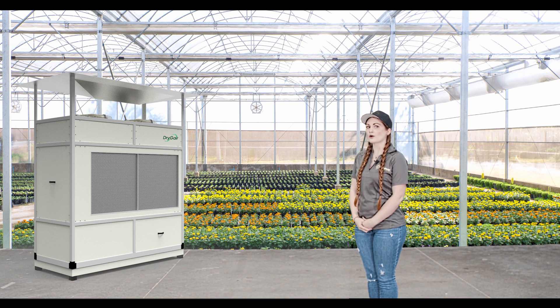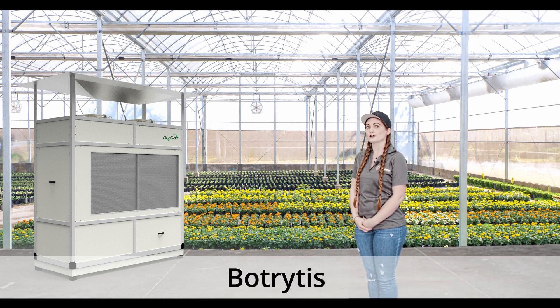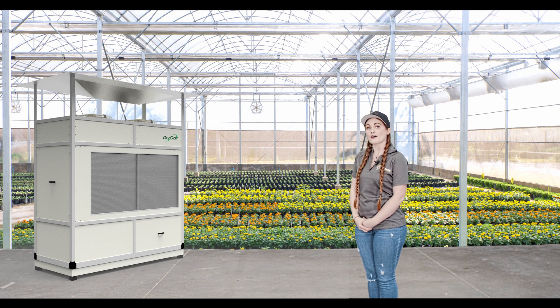Brands A, Q, and Z operate more like a traditional fan because they simply blow the treated air out in a single direction. Combine the inability to push treated air throughout the room with low CFM and you have a recipe for microclimates and crop diseases like powdery mildew and botrytis. Oftentimes, the grower will place ceiling fans throughout the growing space to assist the dehumidifier with air circulation, but that solution can oftentimes make matters worse by creating air barriers that restrict the movement of air rather than help it. When choosing a horticulture dehumidifier, it's always a requirement that you pay for and receive 360-degree air distribution.